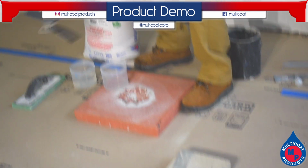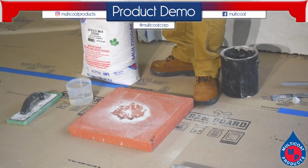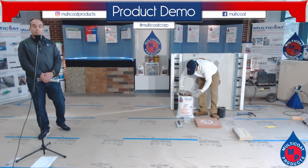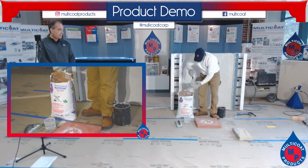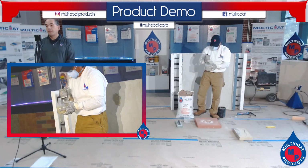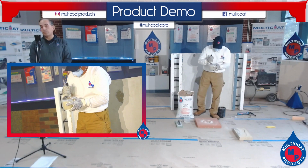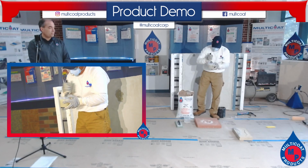Next product we're going to show is our Speed Mix product. It's our hydraulic cement. It has a rust inhibitor inside, but the beauty of this product is that it sets up really fast. As you'll see, as Alfonso is mixing it here, in about 3 minutes it'll set up. It'll get to about 4,400 PSI. And when it fully cures in 28 days, it gets up to 6,600 PSI of strength.